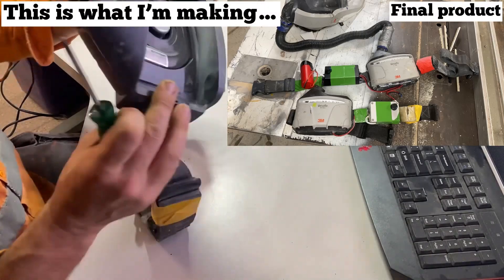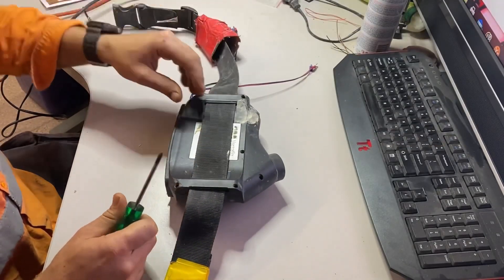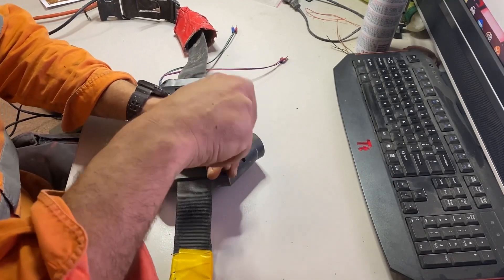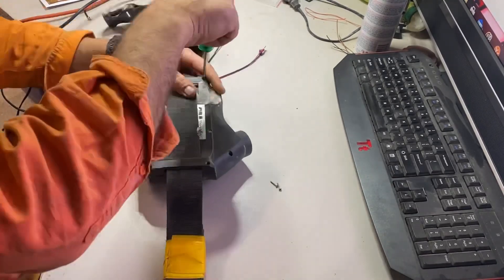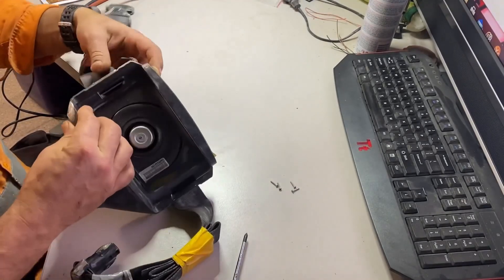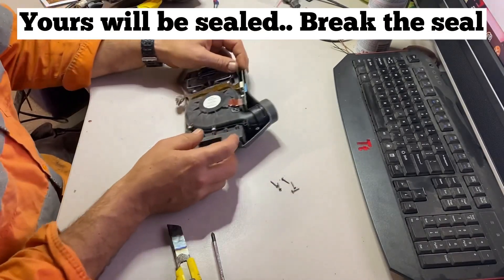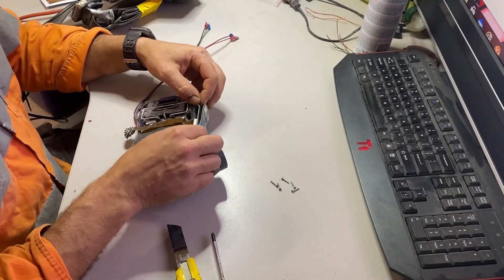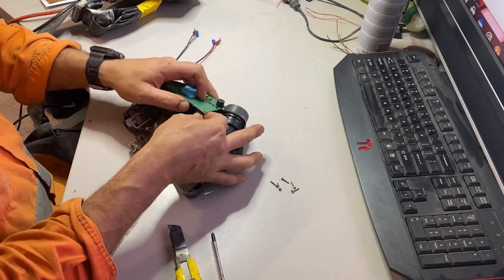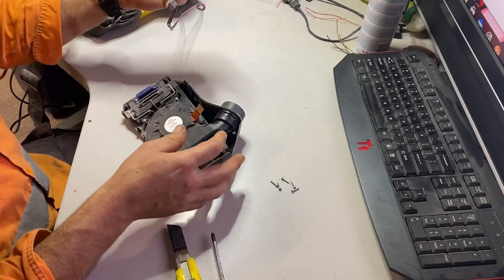Your Versaflow won't look as mashed up as mine, I'm sure of it. But first you've got to undo the five screws on the back. Pull the card out like so, then just pinch this ribbon really hard and it pulls out like that.